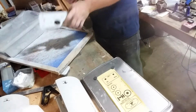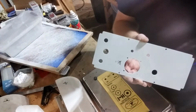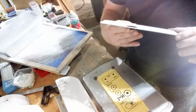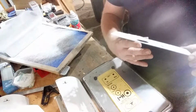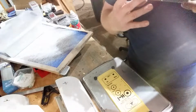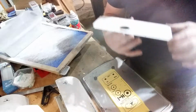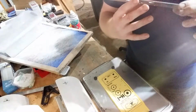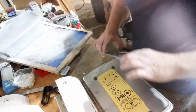You don't want it to be very thick, because what you're gonna wanna do is let it dry until it just skins over just a little bit. Like, it'll go from looking wet to just having a skin of dryness. It'll still be tacky. You wouldn't want to touch it. And that's how it's going to serve as a medium to transfer our toner. If you get this layer too thick and it doesn't dry good, it will drag during the transfer process.